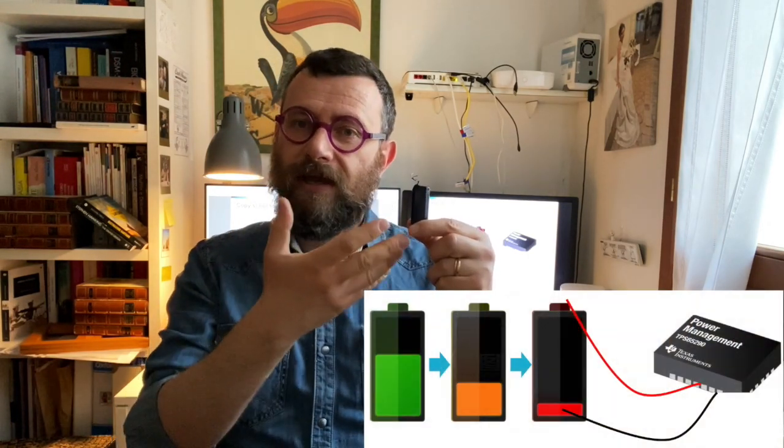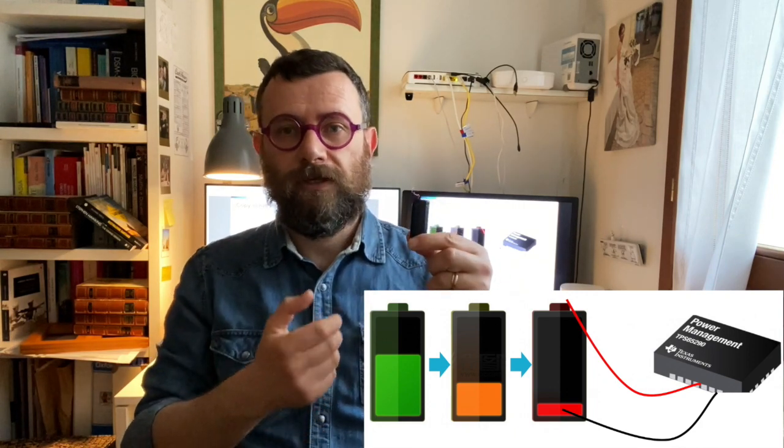This is a lithium-ion rechargeable battery, and this one is a rechargeable battery as well — completely different form factor, much thinner. They are both used in portable electronics. You probably want to test your circuit when it's sinking current out of the battery, check your power management unit, track changes in open circuit voltage and series resistance, and test what happens when a certain voltage level is reached — maybe a shutdown.